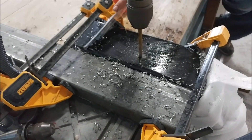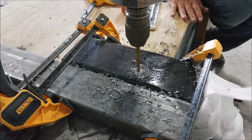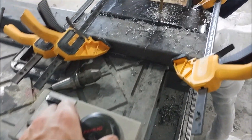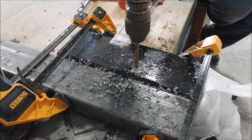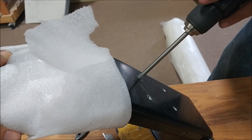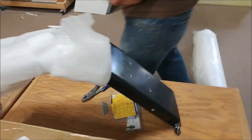This is one of the main gear legs — the black one that's currently on the machine with the end mills on it. When we bought these legs we didn't know exactly how we were going to attach the retraction mechanism, so we've got a bracket with four holes in it that's going to be bolted up to that. You can see I'm just slowly lowering it down while Jeff clears the shrapnel coming off and adds more oil. We've got those four holes done and had to ream them with a reamer because the AN bolts are a very snug fit — they're three-eighths of an inch in diameter. That one's done and we'll do the other one probably sometime tomorrow.